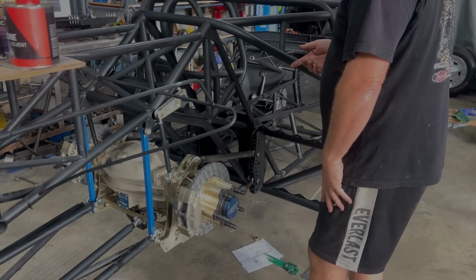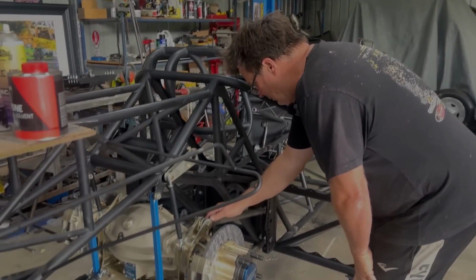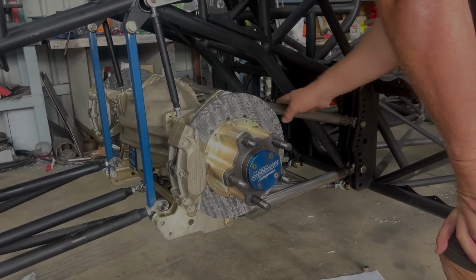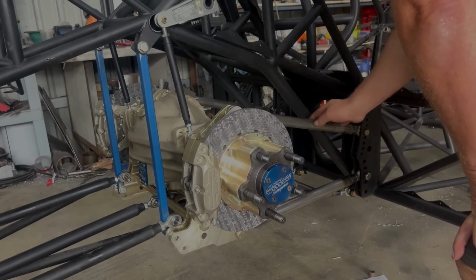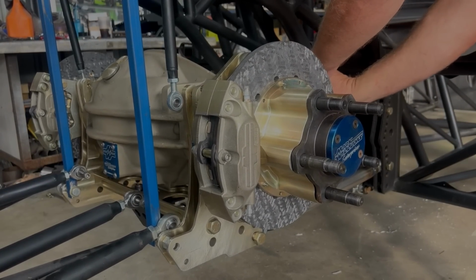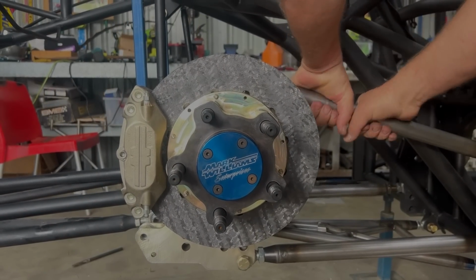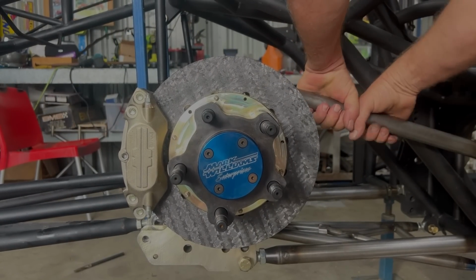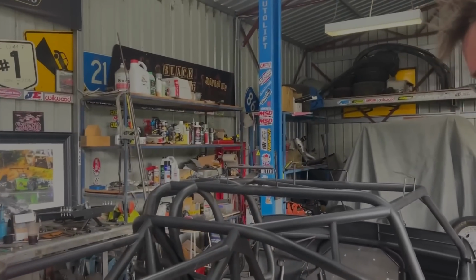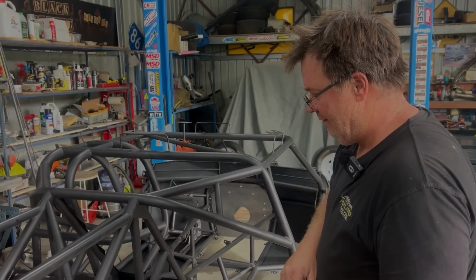So another way that you combat this issue is if you hear people talking about winding a couple of flats of preload into the rear of the car, well, that's when you lengthen this top bar on the forelink, and you'll see that it's actually lifting the rear of the car. So the diff's down there now. You notice the diff comes up. That's another way of taking load off this tyre and applying more to that tyre. So that is the role of the ARB, to keep the diff even in the rear of the car.